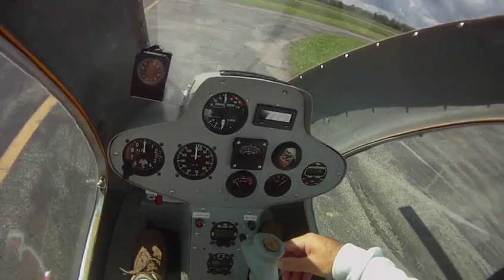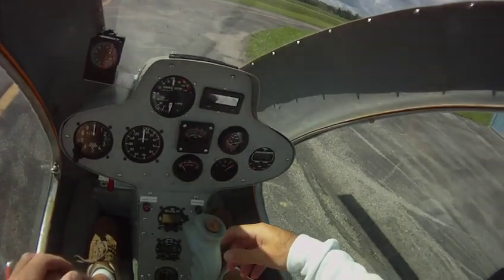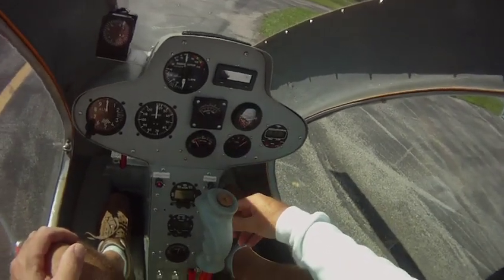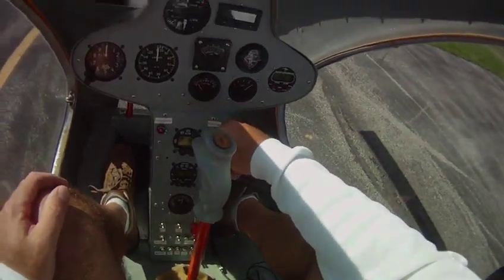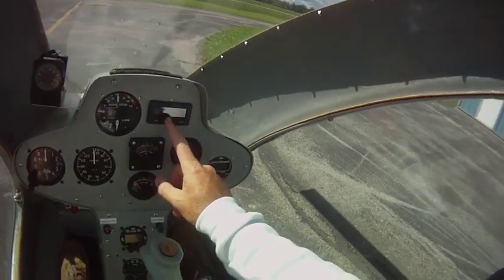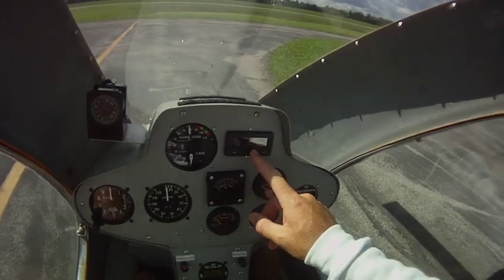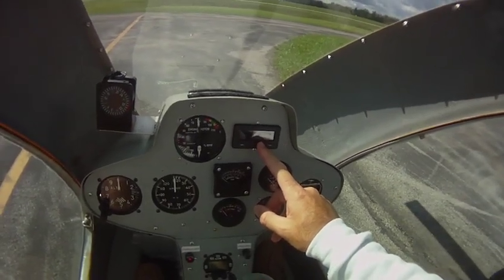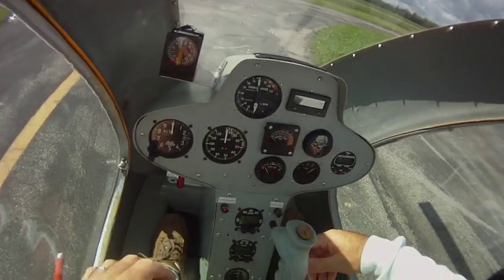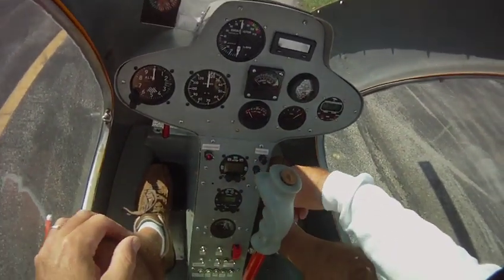Our temperature hardly even came up. Now we're idling at 80%. We have good oil pressure, oil temperature isn't up yet, we're full of fuel. Transmission's at 100 degrees, though it's cooler than that. We're idling at 48,500 RPM right now, which is roughly about 80%. We're still disengaged on our clutch and I'm going to engage that once I get my seatbelt on.